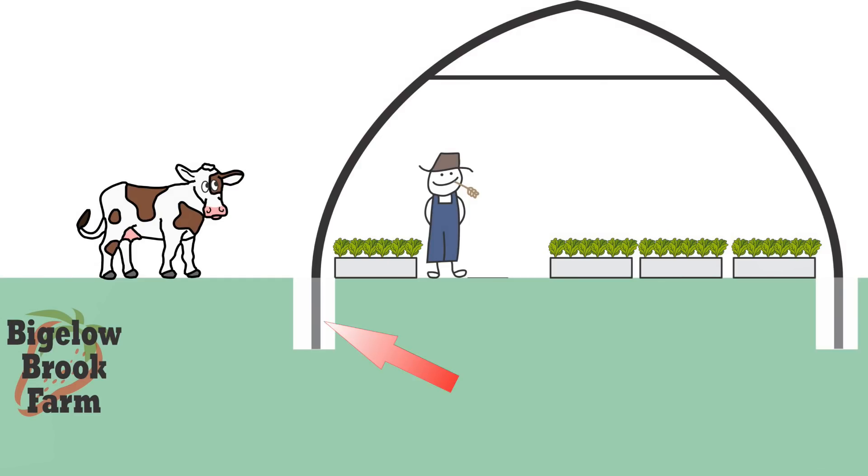Somewhat related to that, I did consider putting insulation along the trench that I had dug originally. Once I set the posts in, I was going to put some insulation down — like a 2-inch foam board around the perimeter — so that the base of the greenhouse would be somewhat protected from the outside elements during the winter. I decided not to do this mainly from an expense issue. It was going to be nearly $1,000 in insulation, and backfilling with all the rocks would just start breaking apart the insulation. It was just going to be too much work.